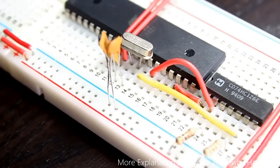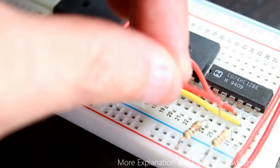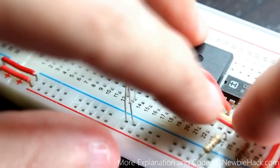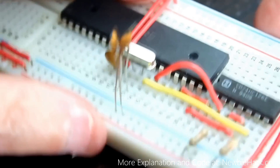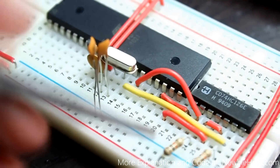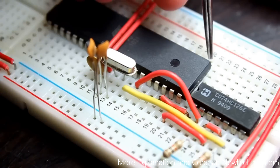Pin 3 already has the pull-up resistor. I've changed my mind on the second buffer's control pin — I'll put it on PD6 rather than port B, keeping the LCD control pins on port B. The control wire goes from pin 4 to PD6. Pin 7 connects to ground.